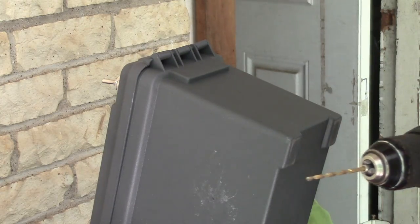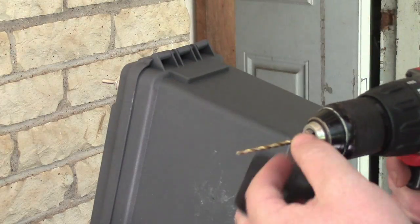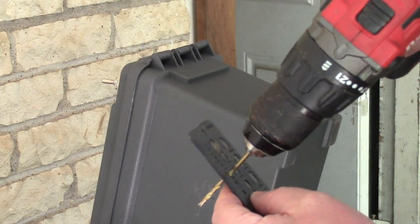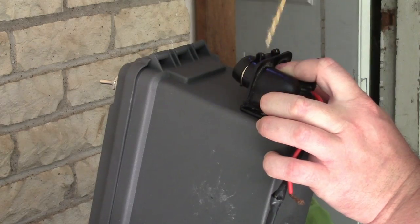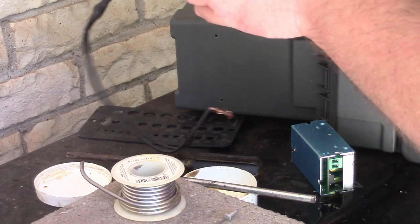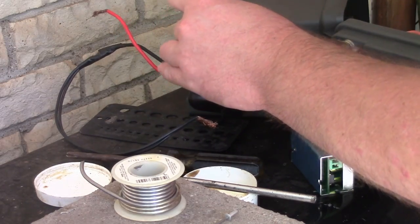So I didn't quite find the size I was looking for. This drill bit is labeled a 1/8, but it fits in the 7/64 hole. I'm gonna drill this thing, and then I put the rivet through the holes.